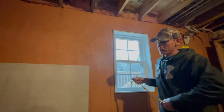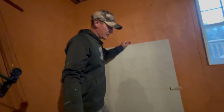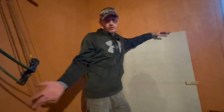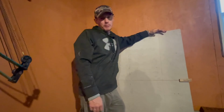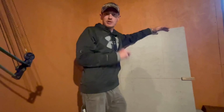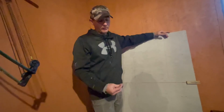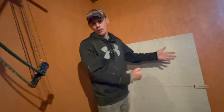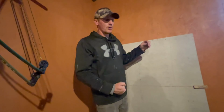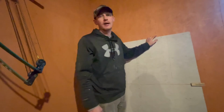When I was taught how to use a brick ruler, it was a lot different. My boss had a brick ruler, and we had a modular ruler. Modular is more for commercial work, and everything we did, we would use the modular ruler and just mark it on 6s. The modular 6 works out good for brickwork landing at the same height as block work. So that's what you would use a modular ruler for: block work and stuff like that.